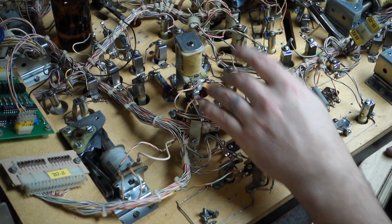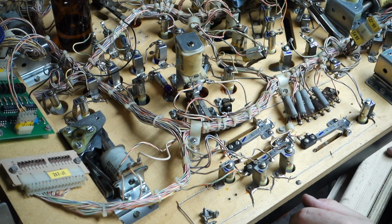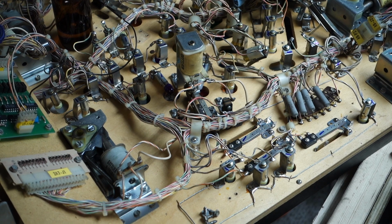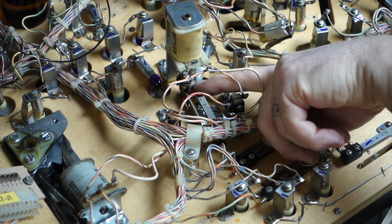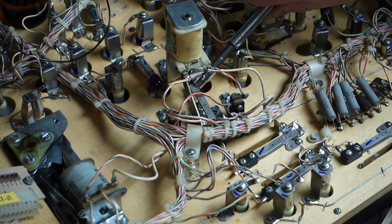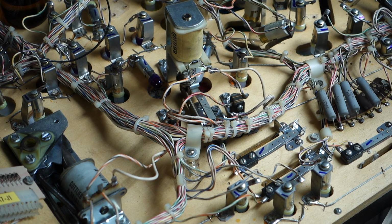As you can see, that wasn't that hard. To do this, you just reverse the order of everything I did to take it apart. I'm sorry I didn't do that part, but I was busy taking apart the playfield and didn't even document removing the slingshot assemblies. But as you can see, that leaf needs to go underneath. So when you hit a switch, it'll fire the coil and it brings this switch up, which in turn hits this top switch here, and that's what gives you your points. But yeah, that's smooth like butter.